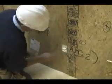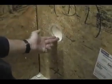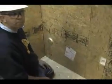notice what's right there is that horizontal chase. This horizontal chase runs all the way along this wall, comes over here to where I've created this access hole where the installer has labeled and marked the deck and the wall, so the electrician can now bring his wire up this vertical chase to this height where I can then pull the wall wire over to where the box is going to go, and then I'm simply going to take the plug, put it back in the hole, foam it up, cover it up, and once we're done, you'll never know that the electrician came this way.